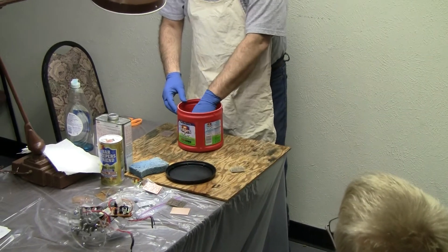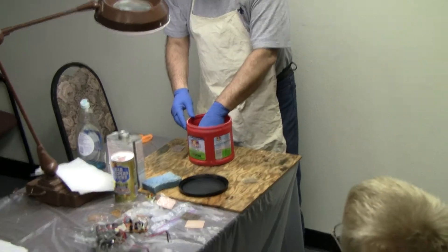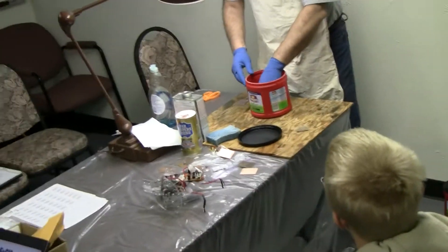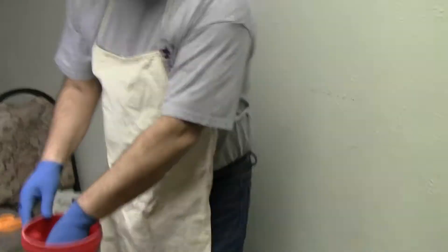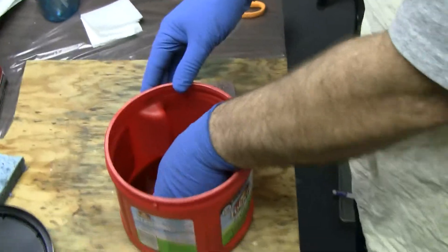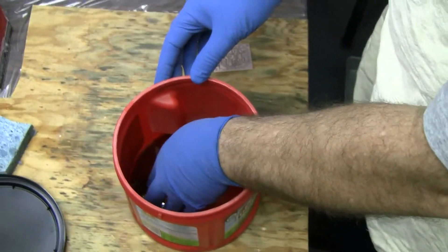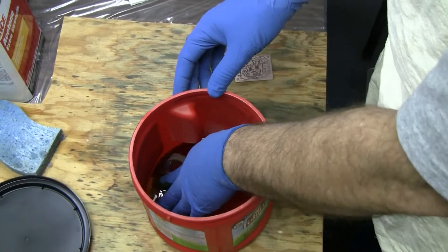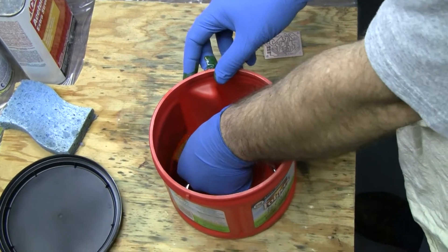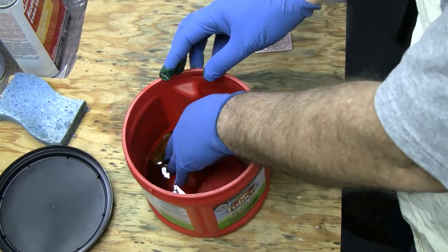I'm going to set a good impression for the younger types here. You mentioned that it will stain and that it's an irritant, but is it poisonous if you get it on your skin? No. I always wipe it off as soon as I can. I have had it get above my gloves a little bit without knowing, and I would end up feeling an itch — sort of like something you'd want to scratch. That seems to be about the level of irritation. Now, since this is a new sponge, I'm trying to get it completely saturated with the etchant.